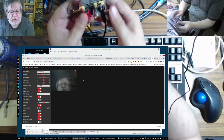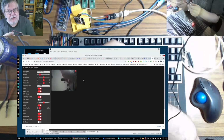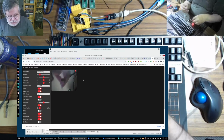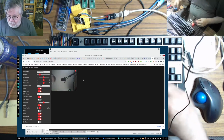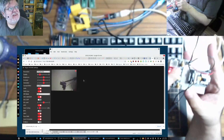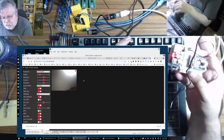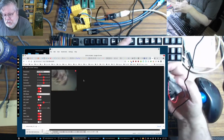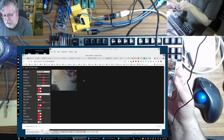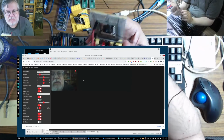So in theory, on this one, if I had a 9-volt battery, which I don't have, and I have this, which is a 9-volt adapter, and I put it into here, my poor 9-volt battery is only 7 volts at the moment. This little board here needs a minimum, I think, 7 to 12 volts, and my 9-volt battery barely is 7 volts. So there's loss going through the little voltage converters that narrows it down to 5 volt or 3.3 volt. So that's why I have the AC adapter on. But in theory, I could have this as a portable one.